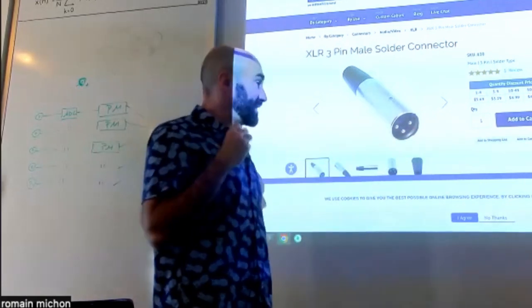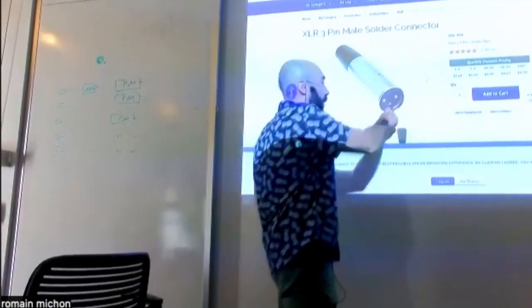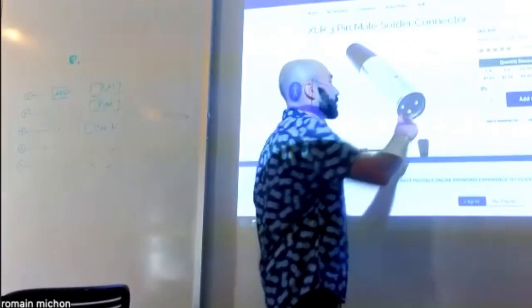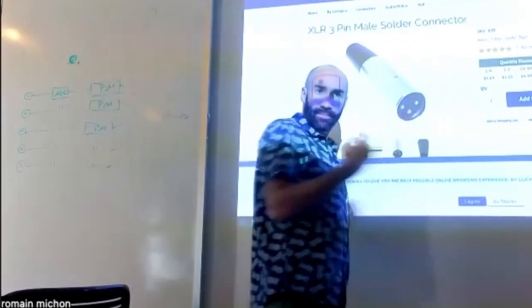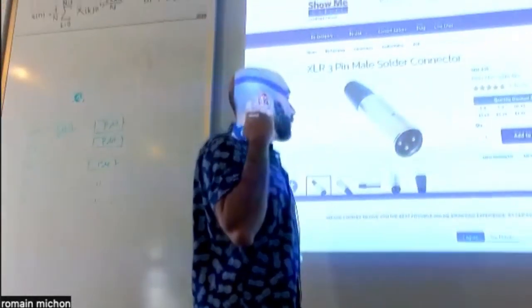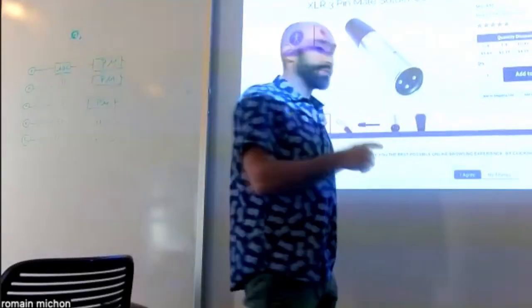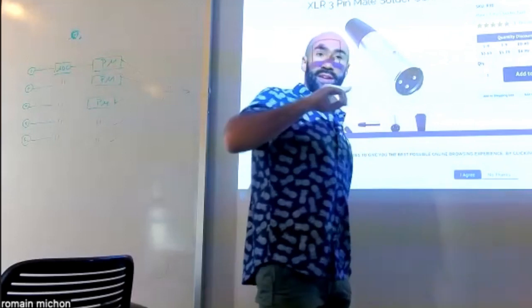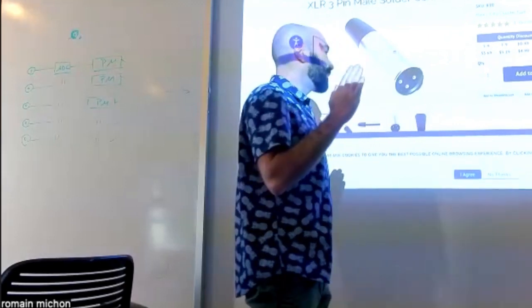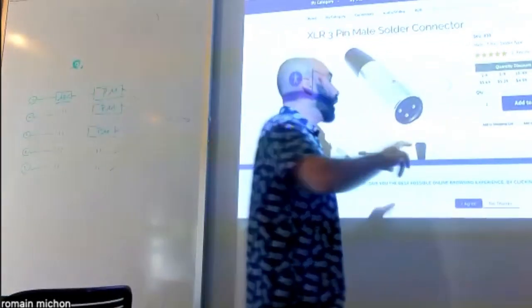So with TRS cables, you do this trick that one of the pins is gonna be used as the ground, so that's easy, but then you're gonna send your signal, the positive signal, twice. One of them is gonna be the original version. One of them is going to be the original version shifted just by pi. So you basically just do a phase inversion of the signal.